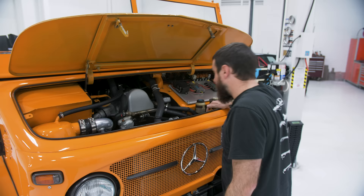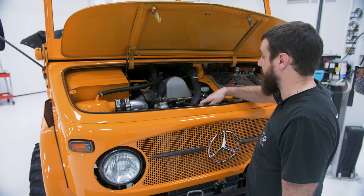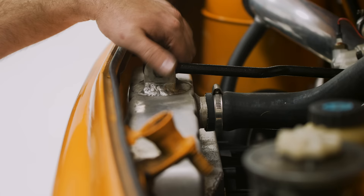You can't really see the engine mount down here, but everything is designed to pivot because of that — the engine kind of floats a little separate from the cab. That's why the radiator is mounted to the engine by this little link here, mounted on two rubber bushings at the bottom and then one up here, so it kind of just floats with the engine in the frame.